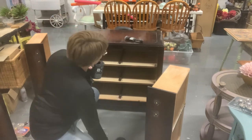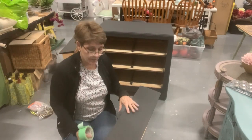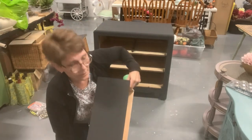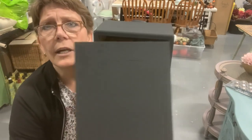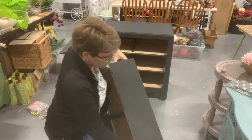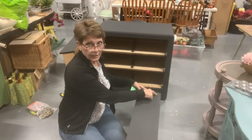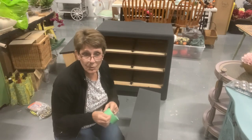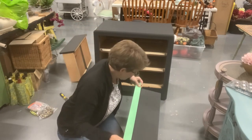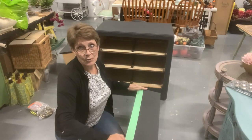So this is just straight paint. I've got two coats of paint on here and it's dried entirely. It's important because I'm now looking at taping off, and these drawers — let me just see if you can see — see that outline? Where it's all kind of engraved. I'm using that as my guideline, but I'm not going to worry about doing the curved-in on the edges. Like, these edges arc in — I'm just going to square it off because the treatment that I'm doing is going to add texture. So it's going to hide that, and those lines just make it a heck of a lot easier to follow and get a nice squared-off edge.